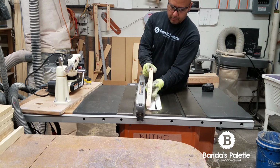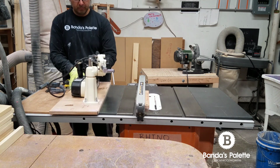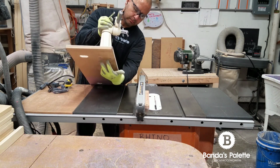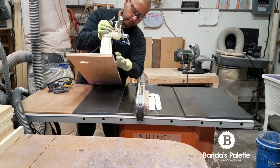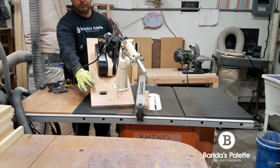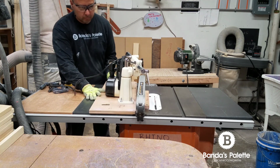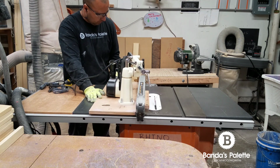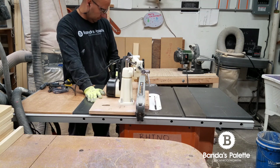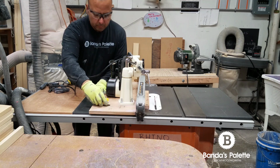And then I use a setup stick, just the thickness of material that you're going to cut. So I usually use 3/4. Here I'm showing you how I mounted the power feeder to the scrap piece of plywood, and the holes that I drilled out for the mag switches to help me set it up. At the end of the video, you'll see I have these marks that help me to set it up quickly and easily.